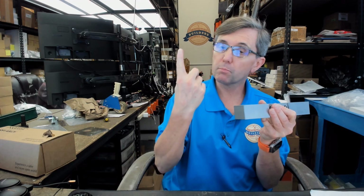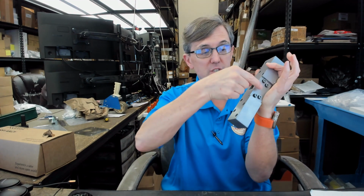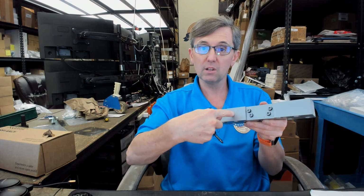So an end load means that you are literally attaching the spindle, and it pertains to overhead closers and whatnot, through the end or the edge of the door, and this would literally be prepped and then this securing plate would be right on the end. This is more like the Rixson 587 arm in the sense that it's side load, which in many applications it would be appropriate to have a side load arm, because imagine in your mind's eye a wood door, and a massive wood door, 600 pounds.